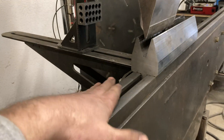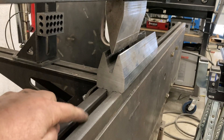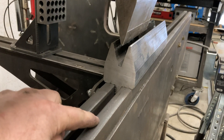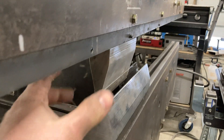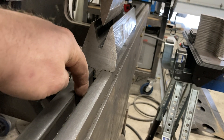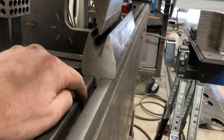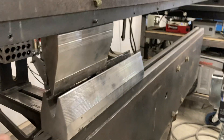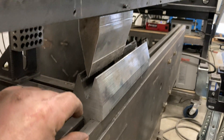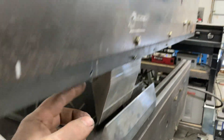This is all homemade stuff, but it's basically built to take the old American standard style tooling, which for me was the simplest. You just need a half-inch wide groove, three-quarter deep — or maybe it's five-eighths; I don't know, I made mine one inch deep just to be safe.